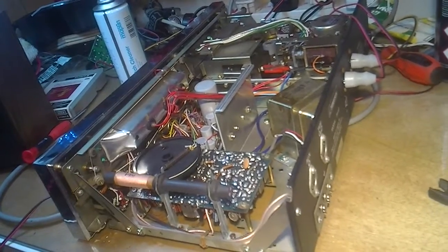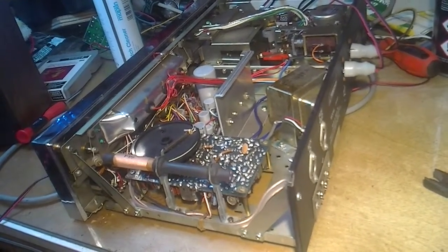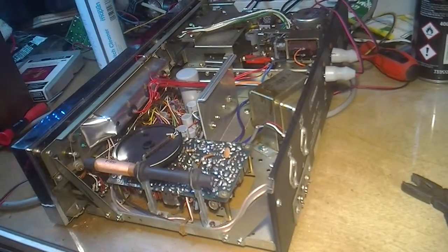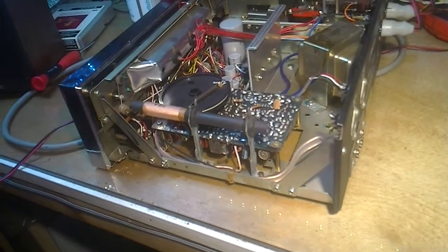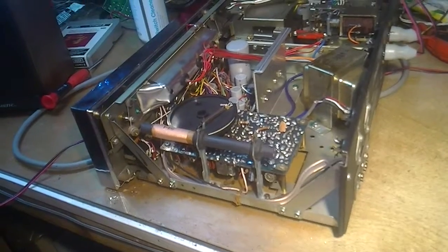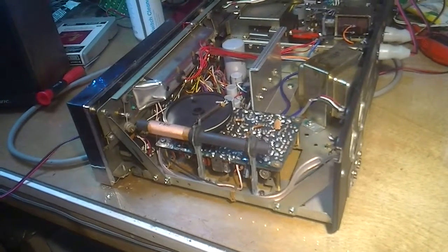The amplifier made the most peculiar noises — sounded like it was down a sewer. I know what you're thinking; some people are saying yeah, well, 8-tracks always did sound like that. Well, they can sound pretty decent if you get a nice machine, and this is very nicely built. But one problem was that the FM radio part of it hadn't worked according to its owner for the better part of two years, and yes, it did need a few new capacitors. A lot of people think changing all the capacitors out will fix it — it isn't always so.